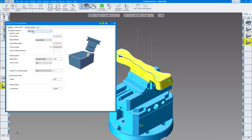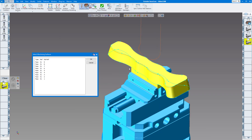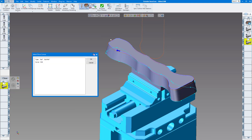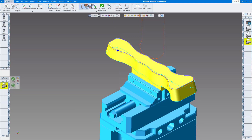Deburring is under Surface Paths. I choose User Defined; it says 'part surfaces' and again you have to choose the whole solid, not just a surface, otherwise you might not get the Do It or Redo button. Under User Defined Edges, select the edge you want to deburr. You can choose constant depth or constant width. Trim doesn't matter here — no inner corners — so we're good.